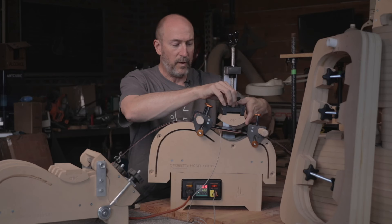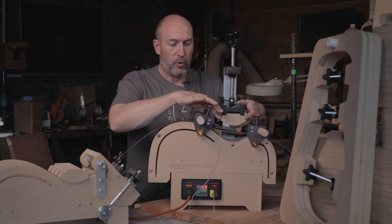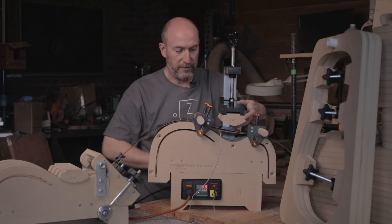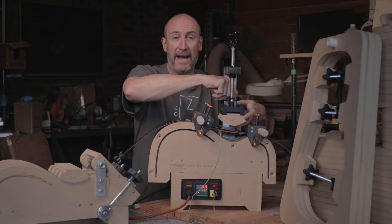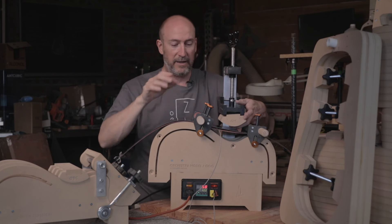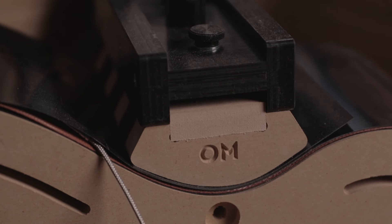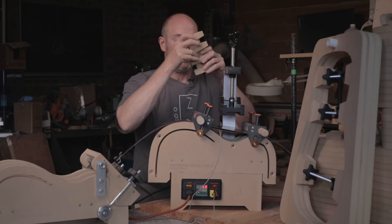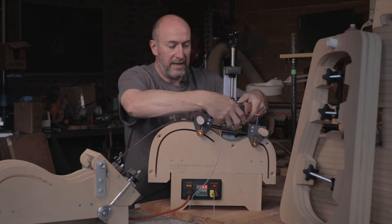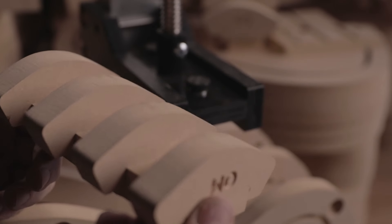The waist form and sliding piece of this assembly is unique as well. It was redesigned to help put pressure evenly across the waist form. You'll notice these waist forms are a little bit larger than what you'll see on a lot of other machines — we want an accurate press so when you bend your acoustic guitar sides they come out the same shape as the form. One way to make that happen is to have a larger die. It's a rigid assembly, so everything is aligned — each one of these waist forms is aligned to all the others in the assembly.